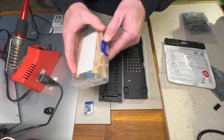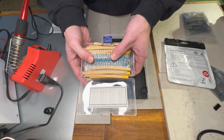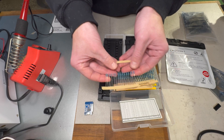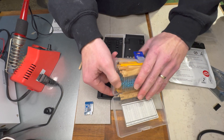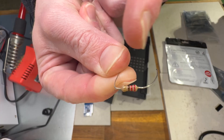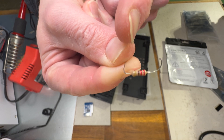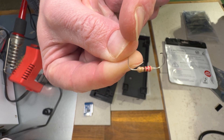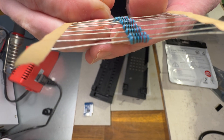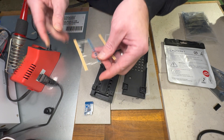I also ordered a set of resistors of many different ohms. We'll be using 220 ohms today, although there's a range between 220 and 600 ohms that you can use. You can look up how to map those color band numbers to the resistor value. Here's the 220 ohm resistor — these are also 220s with the same two red bands — and we're going to use one of these for our LEDs.